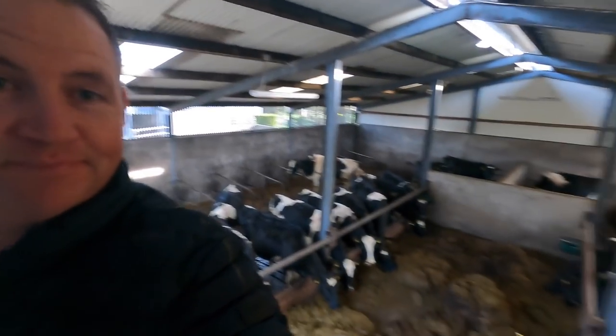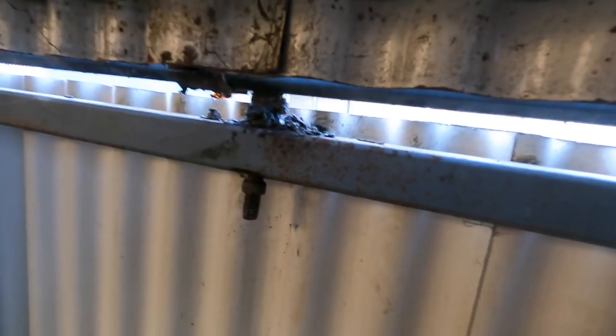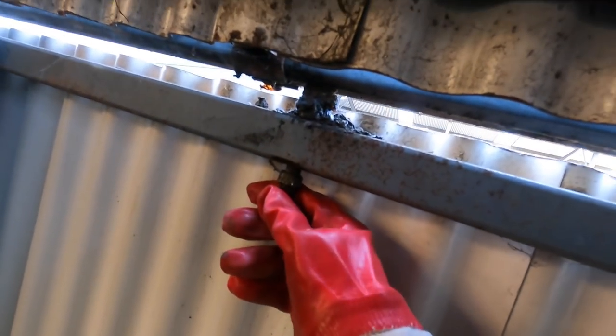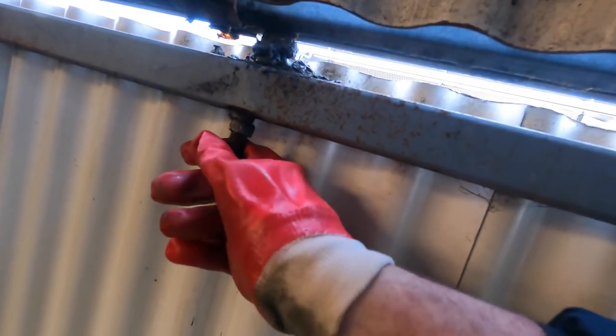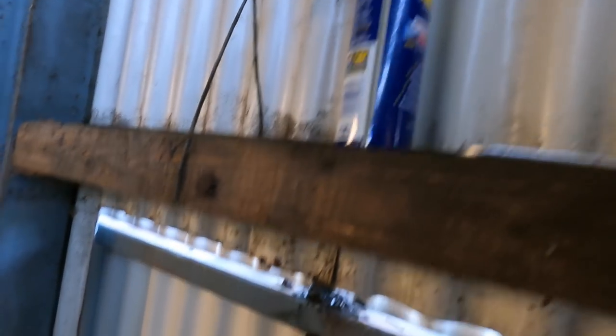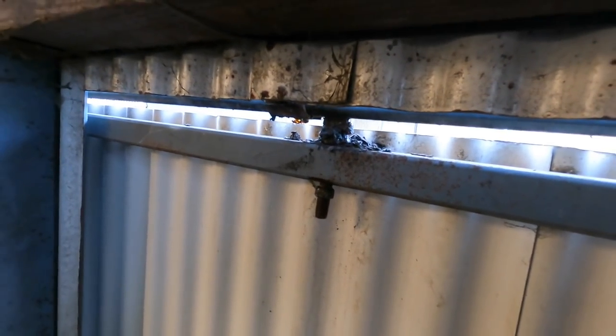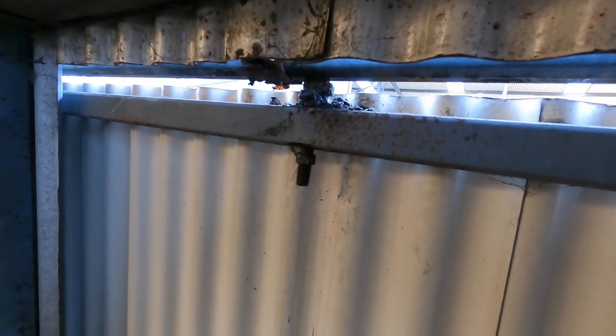Hopefully I can pick up a set locally at my co-op. Actually, this is not the one I welded before — the nut has just pulled through the box iron from movement. All I need to do is screw it off. I'm looking to get a nut because the threads are still quite good. A bit of WD-40 — starting to loosen there already. I'll get a washer on it and that'll stop it from slipping. That'll do for now — a quick fix — and it allows me to carry on with the jobs I had planned.